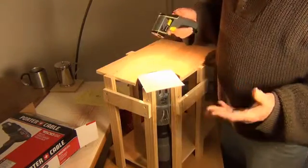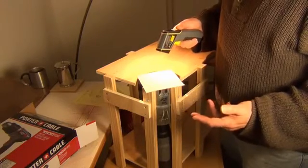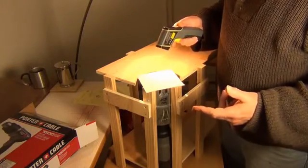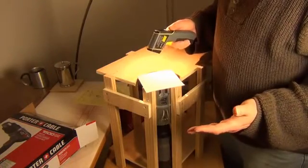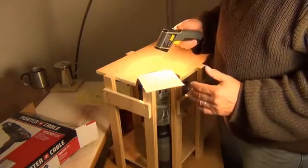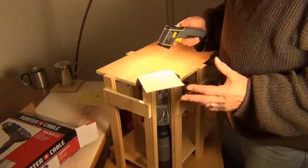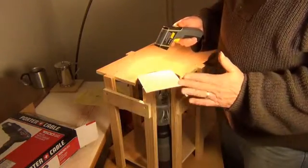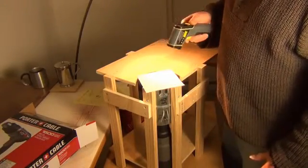Now, the instructions for curing this type of ink is 2 minutes at 160 degrees Celsius. So if we go 2.5 minutes at 140 degrees Celsius, that's okay. If we go for 2 minutes at 200 degrees Celsius, that's okay. But what we're looking for is something between 140 and 200 for about 2 minutes or so. We don't need to go to 3 minutes, I don't believe.